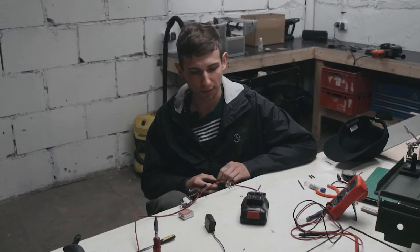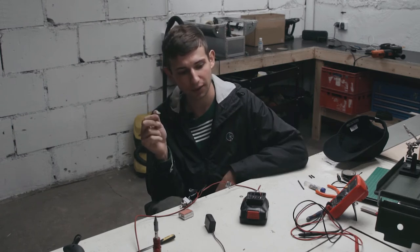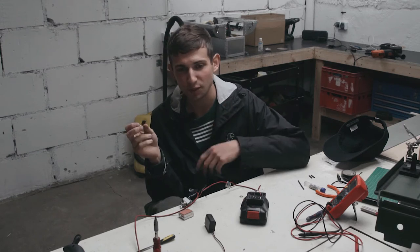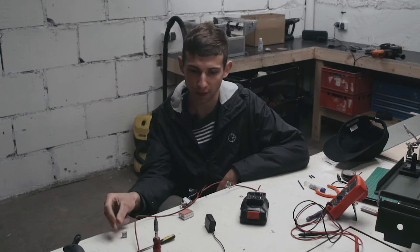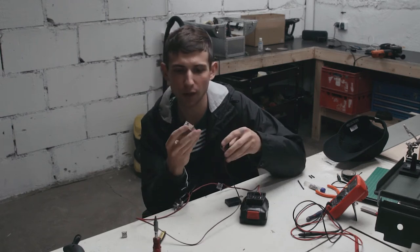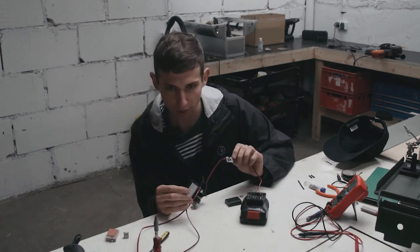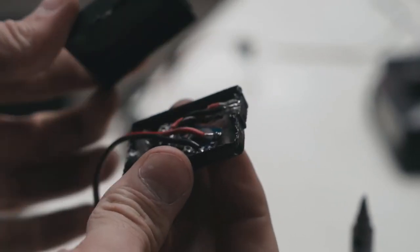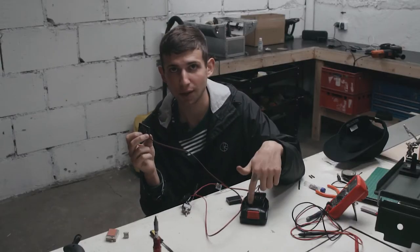The plans are changing a little bit. At first I wanted to have two USB ports to connect my camera, but it didn't work because the camera couldn't recognize the USB device. So I came up with a different idea — I took one of my old camera batteries, took it apart, removed the actual battery cell, set my voltage regulator to 8 volts, connected it to the little board that was inside the battery, put it in the camera, and it worked beautifully. I basically made a little dummy battery with a cable that's going to go into the unit.